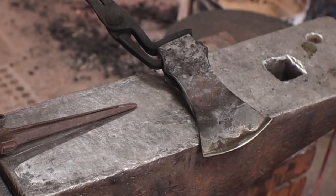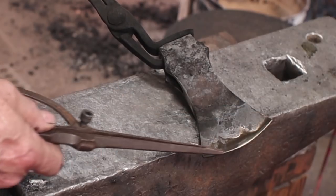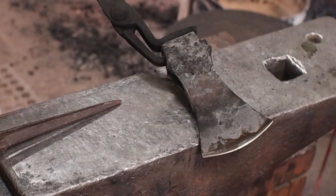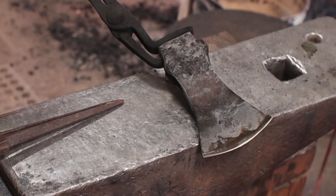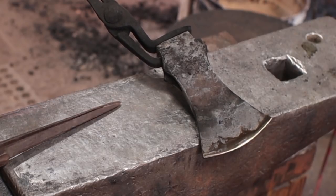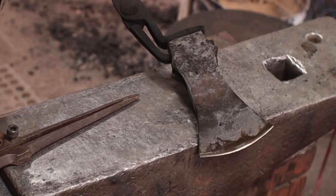Next, we'll be looking for a bronze. And I would ideally like to get this edge to a bronze. And if there's enough heat, it doesn't hurt to do this twice. Really wouldn't hurt to do it three times. It usually is not perfectly even, and it happens fairly quickly compared to hardening and tempering in an oven.